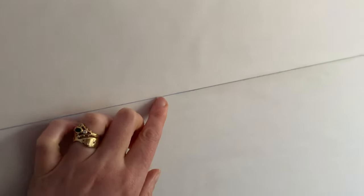I've got the second piece of lining paper up and you might notice there's an extremely small gap — less than a millimetre — which I've left on purpose between the two pieces. This is just to ensure that the paper definitely doesn't overlap, expand and cause a ridge when we put the top layer of proper paper on. Note: you wouldn't do that if you were going to just paint this lining paper rather than paper over it — you'd just put the two seams together.